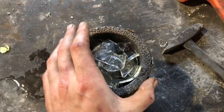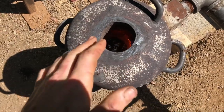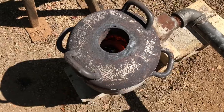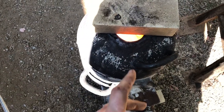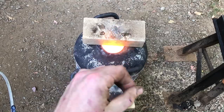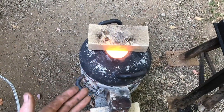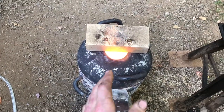This time we're going to put it in there and let the furnace come up to heat with the crucible already inside, let it reach white heat, and cook it for another hour and see what we got. The glass is starting to melt and I haven't seen any sparks from the charcoal burning, so that's good. We're pushing white heat again after about half an hour, so I'm starting the timer for 60 more minutes — but if I look in there after that and don't like what I see, we're going to keep going. This stuff is going to be steel whether it likes it or not. After an hour I can still see chunks of steel sticking up above the molten glass, so I'm going to keep this thing running and check it every 15 minutes until we get good material or the gas runs out.